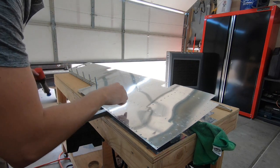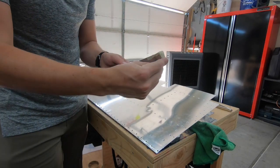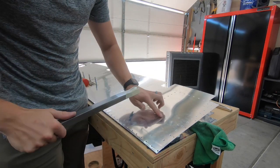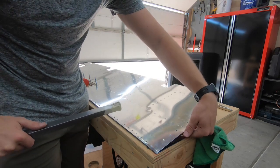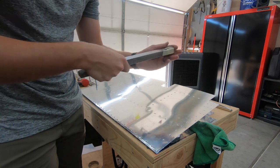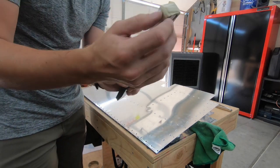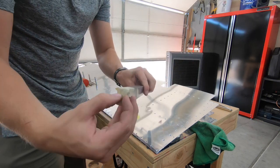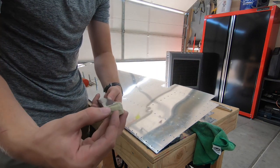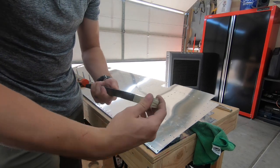Summed up, the way this works is I used a similar method to before as far as making that bumper, to, number one, prevent scuffs on the back side of that spar web, as well as to distance it from the little bit of a radius it has. I just took tape and folded it over itself a couple of times and made a little bit of a bumper, and it helps to cradle that rivet.